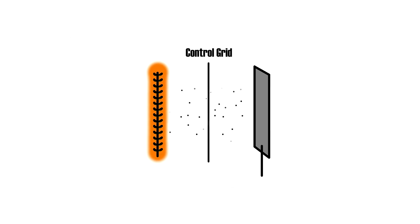The glass tube doesn't have any air inside of it — well, actually it has a very tiny amount, but not enough to matter. The positively charged anode would attract these electrons, and thus a current traveled from the cathode to the anode. But in between these two electrodes was placed a control grid, and when a voltage was applied here, the electrons could not get through. Therefore, you could turn off the flow of electrons by placing a voltage on the grid. The miracle of the vacuum tube was that only a very small voltage was required to stop the current flow, and you could have quite a large current depending on the design.